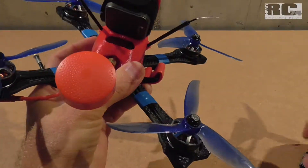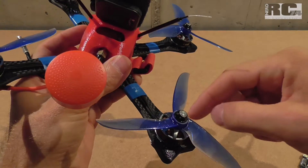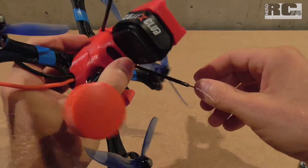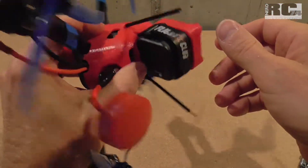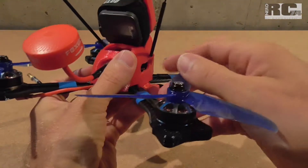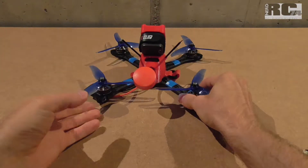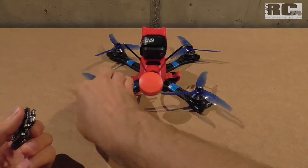the FC wasn't able to control the fast movement. What happened was it turned the motors rapidly up and down in fast frequency and your quad began to shake during the roll. I had this problem with two or three of these controllers. That was the first disappointment.